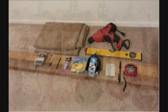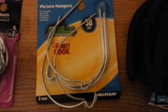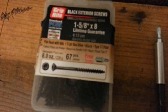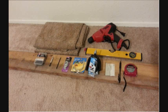Here are the tools and supplies I used to build the guitar hanger: one 6-foot long 2x6, four 50-pound Hercules hooks, four 1 to 1.5 inch screws, one small drill bit, four D-ring wall mounts, five screw-in tool hangers, a pin, a measuring tape, a level, and a drill.